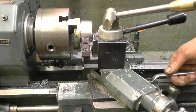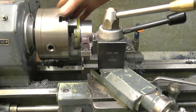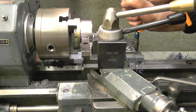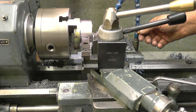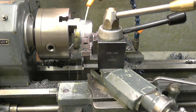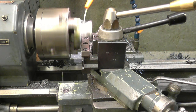My carriage is locked off. Make sure everything is tight. Lay it in the back here. Put some water on as well. Once we start parting off, we won't be backing off — we'll just wind the tool straight in. When you back off, that's when you break the tool or dig in.